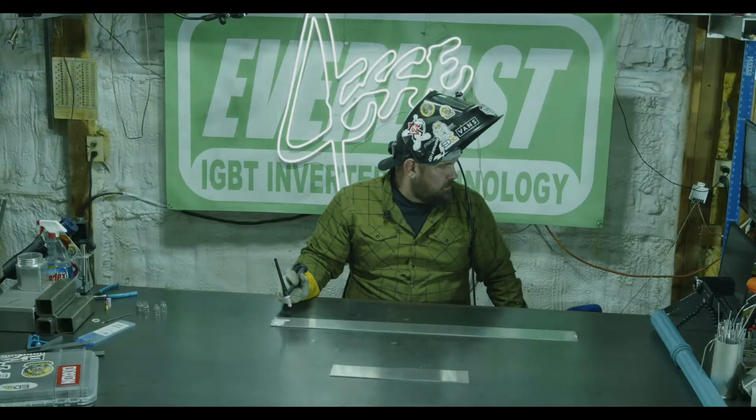Let's get on the arc cam. Try to tell me where I'm at, guys. It's always kind of hit or miss where I'm at. So yeah, too much gas flow can cause porosity. It can also cause quite a bit of turbulence. So I'm going to try to get locked in on this start. So let me know where I'm at on the camera with the start.